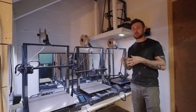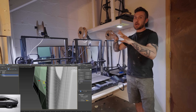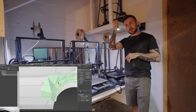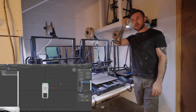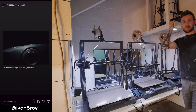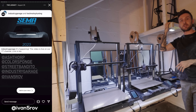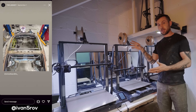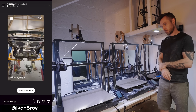We started with a poly model, which isn't a 3D enclosed CAD form — it's a bunch of polygon meshes that make up a form, so it's not exactly CAD accurate. I put something up on my Instagram asking if anybody had experience taking poly models and turning them into a CAD model, because there's a lot of pain and headache in that. Our friend Ivan hit me up and said he'd help for free. He did a ton of work taking all the different panels from Ash and Carlos's rendering, going back and forth on wall thickness and details, and made everything into a proper 3D model. Then we sliced them in Prusa Slicer and ran them to our 3D printers.